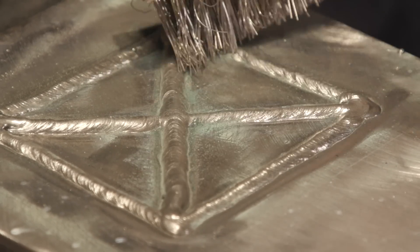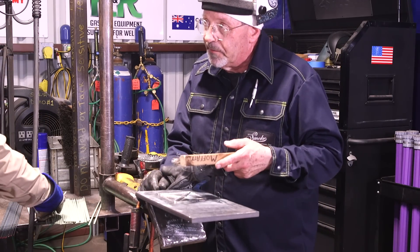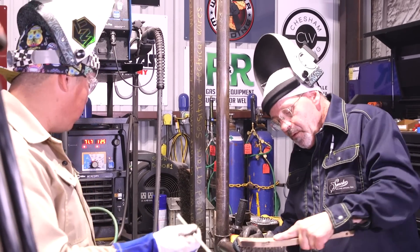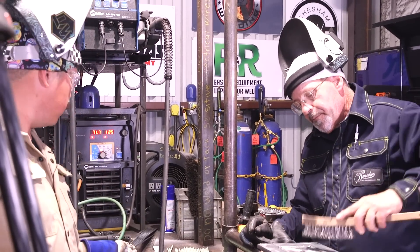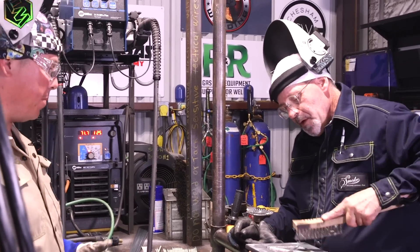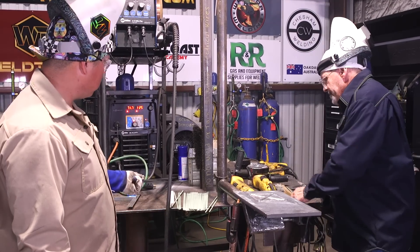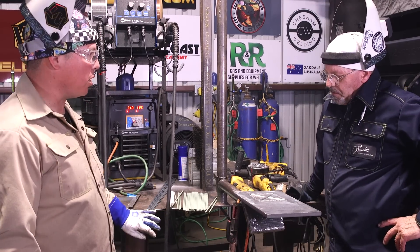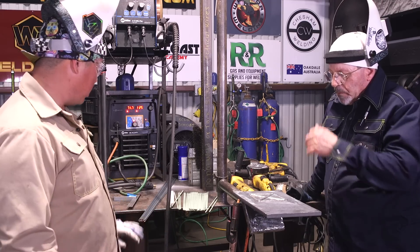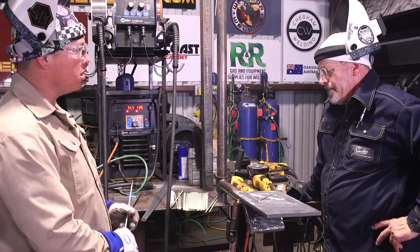The logistics of putting down a stick rod — I don't even know what this stuff costs. Is it super pricey or within reason? It's a little more on the pricey side, but actually this TIG rod over here is a lot more affordable — though it's a little bit harder to find. For TIG, you're going to need to take a bottle with you. This is more for precision hard facing, like wear pins that'll wear out. You'll be able to put it in a little easier and not have to machine as much to get the clearance.